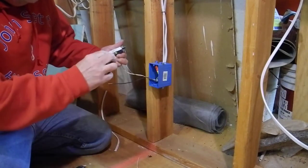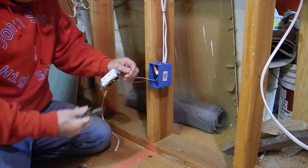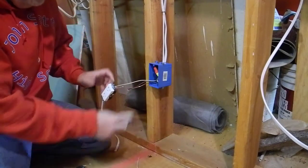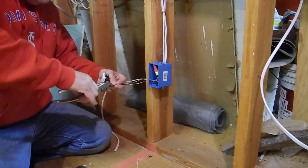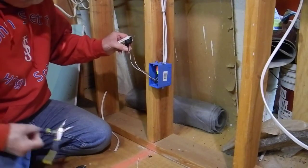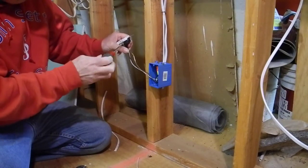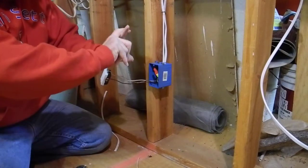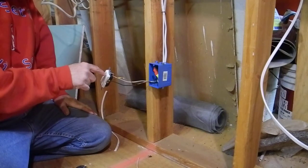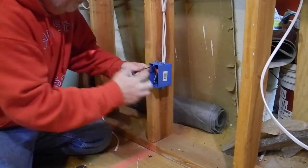Now when you look at this one from this side, it's going to curve this way. I'm going to curve it the wrong way to show you how to deal with that — so let's just say you did it backwards like this. Well, it's crooked. So you could do that — not that big a deal. Put that thing on there; notice how I'm holding it in with my thumb. I can kind of take some needle nose and wrap around there. I'm putting tension on it, tensioning it back with my thumb, so if this thing is on there tight it's not sticking out. Tighten that up. This is about how much wire I like to have hanging out of there — if there's ever a problem and you need to fix this receptacle, someone yanks the vacuum cleaner out of it or whatever, you have some wire to work with.